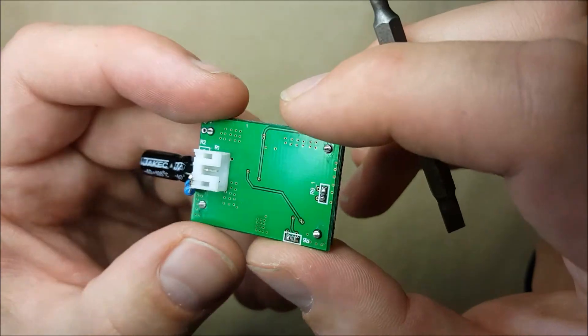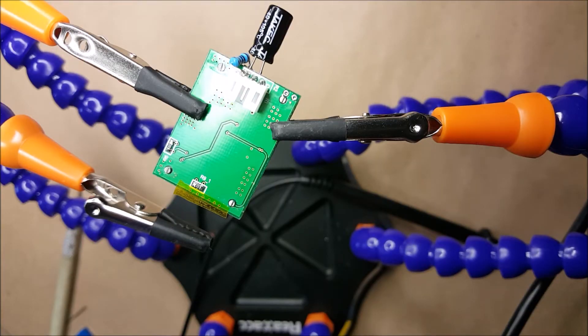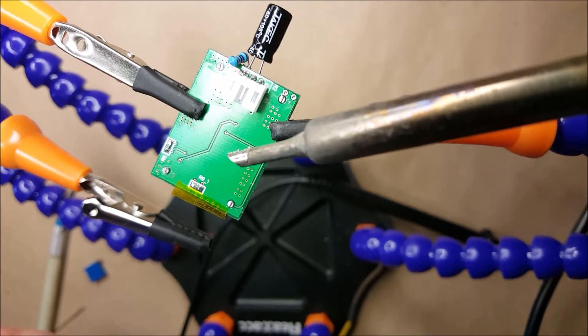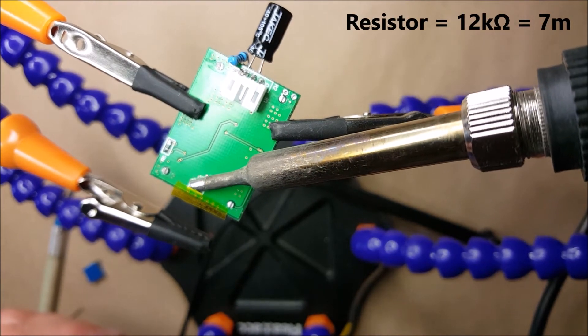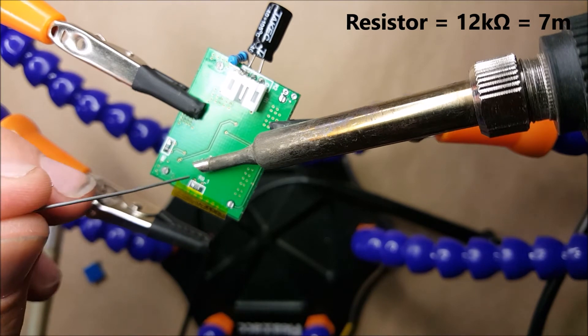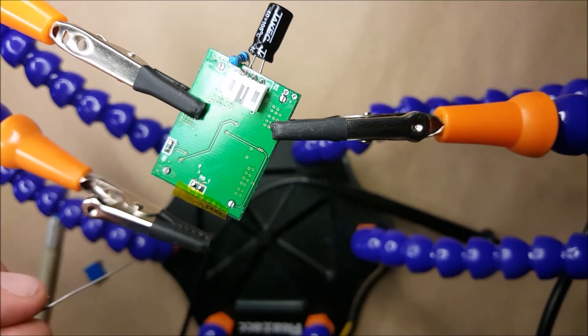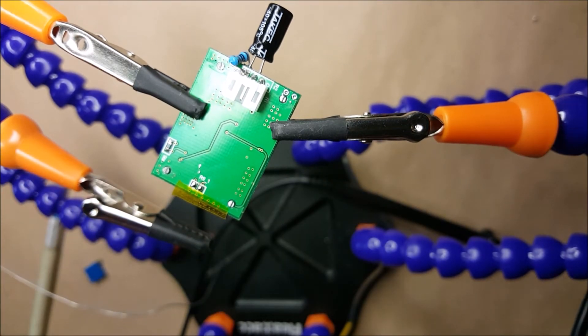So that's my first modification done. The second thing I'm going to do with this board is change over the resistor that sets the range — I'm going to try putting in a variable resistor. I'll first solder it in and then hot glue it. Starting with the solder, I'm just going to remove the resistor which is in place — it's just this little surface mount job here. I put a bit of solder on my iron and off it goes.